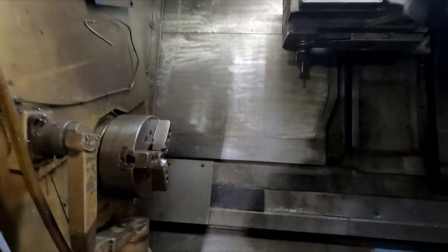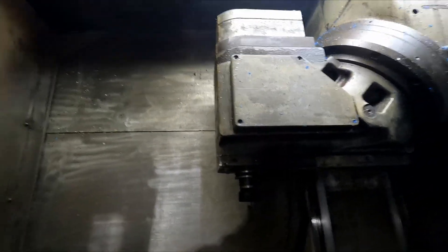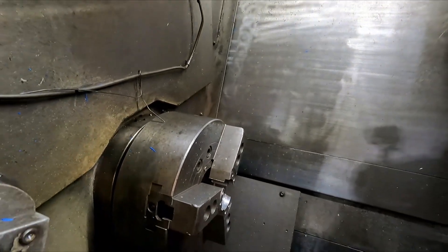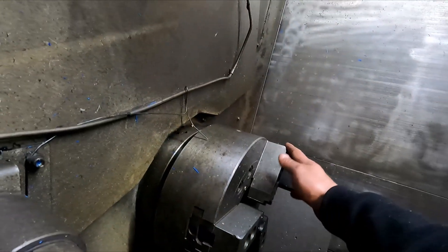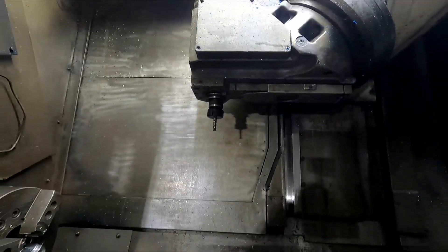The main drawbacks of this machine is clearance. That head is quite large, so you've always got to consider clearance onto jaws, clearance onto the wall, clearance onto the tailstock if you've got it further up. There's always things to consider on that side of things.